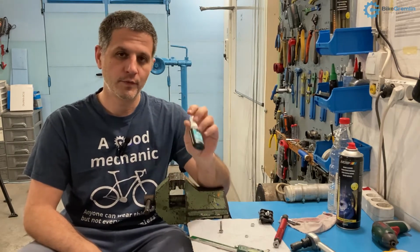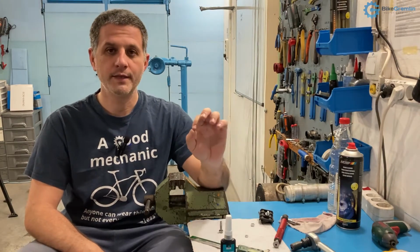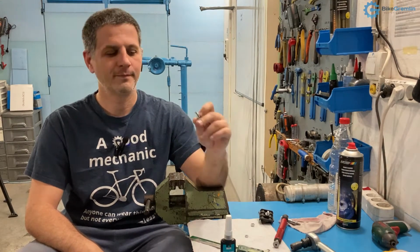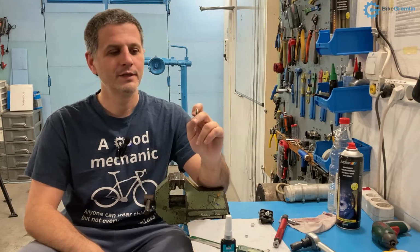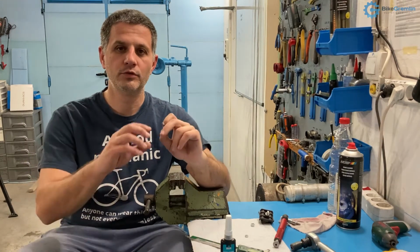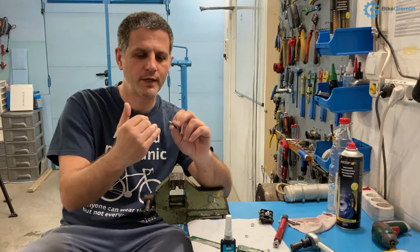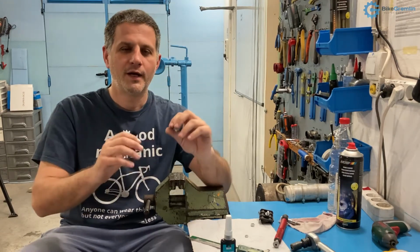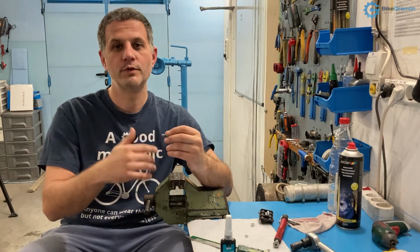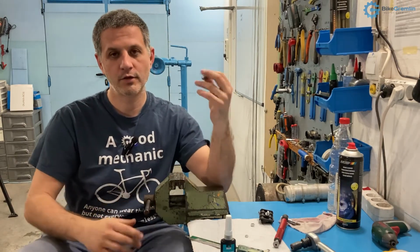When we talk about Threadlockers, they are not like ordinary glues. There are different models and different manufacturers, but most of them work in such a way that when you apply them to a nut or a bolt, they will get in contact with metal, and as long as there is air, they will not begin to cure. Or, to put it in a more casual term, they will not begin to dry out, even though there are some dry Threadlockers. Anyway, they will not begin to grip as long as there is air. So they need to come in contact with some metal and to be in a place where there is no air, which happens when you screw a bolt in and press it tightly. Then there is no more air and Threadlockers start to cure.